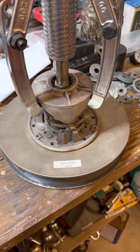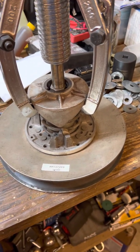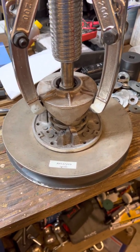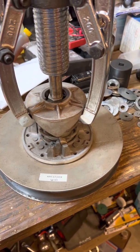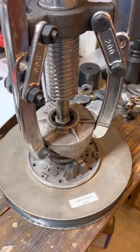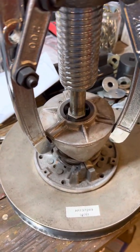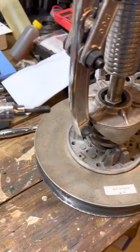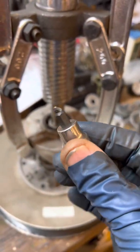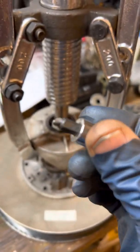For anyone who's got a John Deere 6x4 Gator with a secondary or driven clutch they want to disassemble, I couldn't find any other way to do it. There are a couple clues on YouTube that show how to get snap rings out, but this one has a four millimeter set screw in there that was in pretty darn tight. I tried using just the old school method and that snapped off my Harbor Freight four millimeter bit.